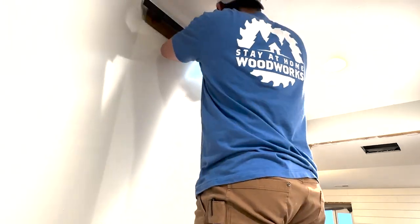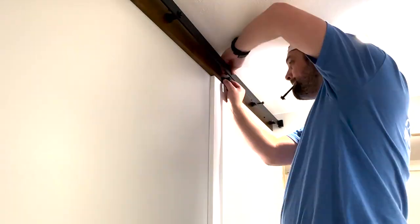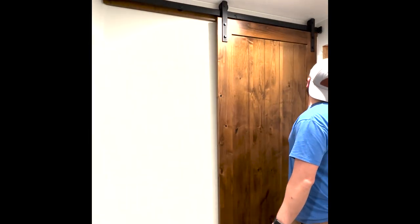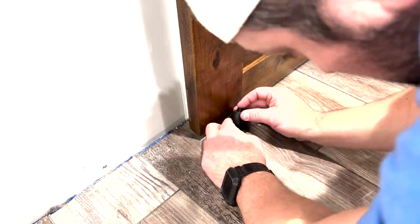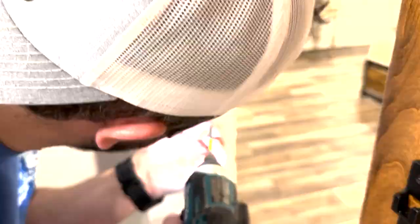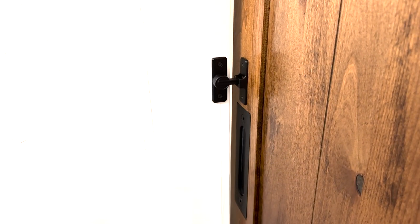Another helpful tip: pre-drill the holes where the bolts that support the rail go — that will make the installation process so much faster and easier. This is always a fun moment, seeing the door fit exactly how it's supposed to. This floor guide prevents the door from swinging out. Last but not least is installing a latch, just for privacy purposes since this is going into a bathroom. There are a lot of different styles; this is a new one I found and I really like it. And just like that, the barn door build is finished.